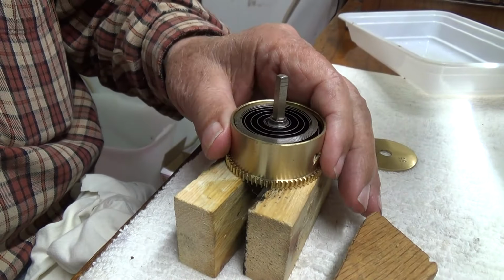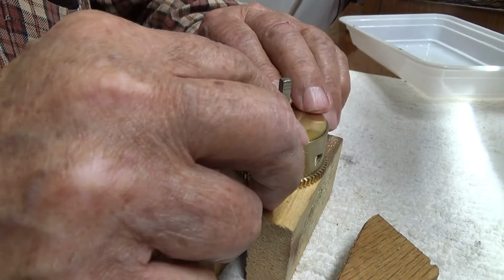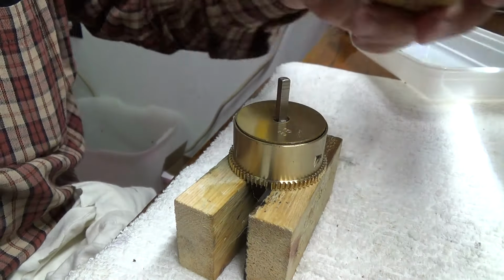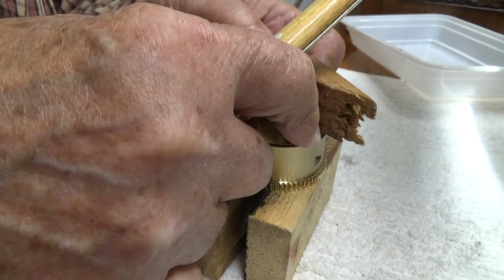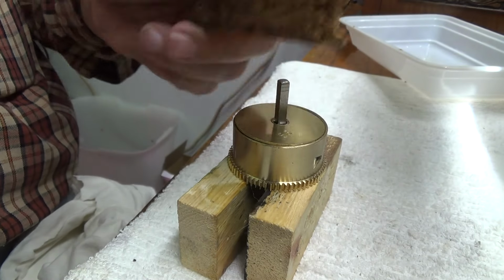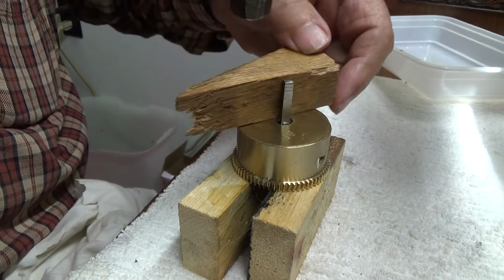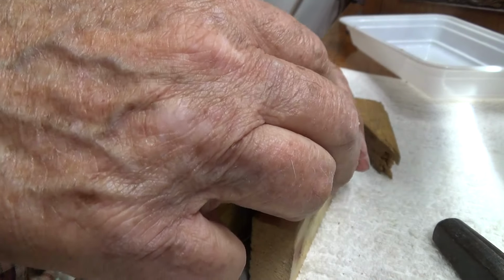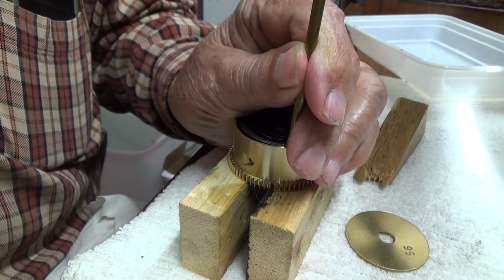Cap back on. Number goes out. That goes in there. The hammer. And we will, gonna give us some grief here. Make sure that spring's all the way in. Oh, there's a problem. Okay, spring's not all the way in. Spring's sticking up here, so I just knock it down in there.